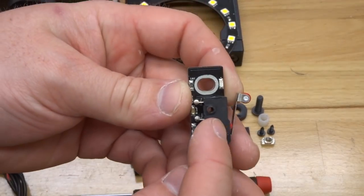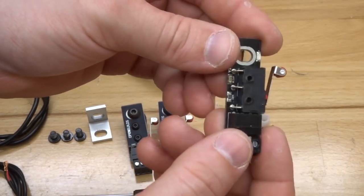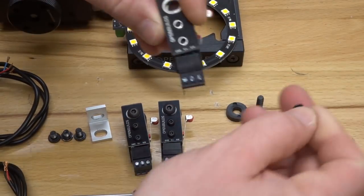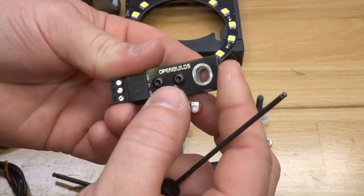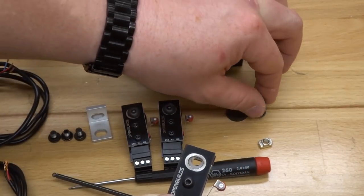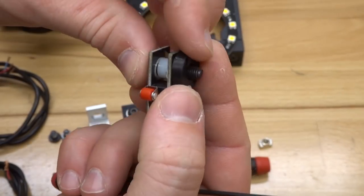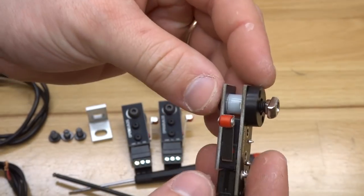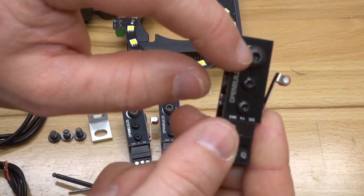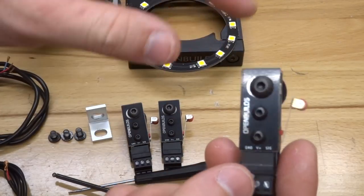Taking the plate with the micro limit switch attached to the PCB — that's printed circuit board material — you'll see the extension connection system is also attached. Place the additional plate in a sandwich configuration and use the M3 self-threading screws to mount it. Then take the nylon spacer, place it between the plates, run the large M5 screw through, add the 4mm spacer on top, and thread on the drop-in T-nut. That completes the assembly. You can change the screw orientation for a different mounting option.